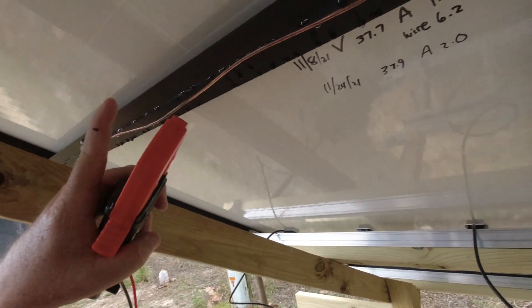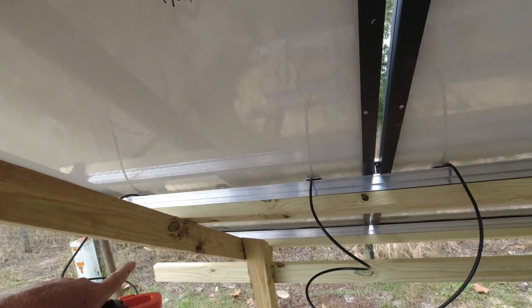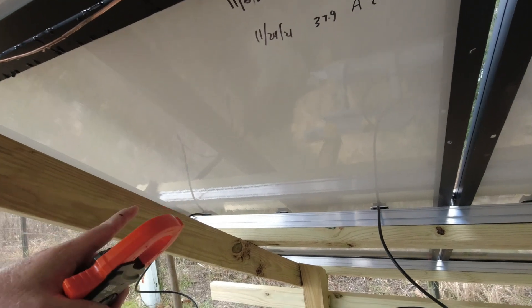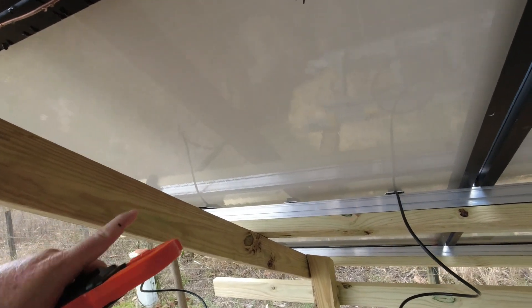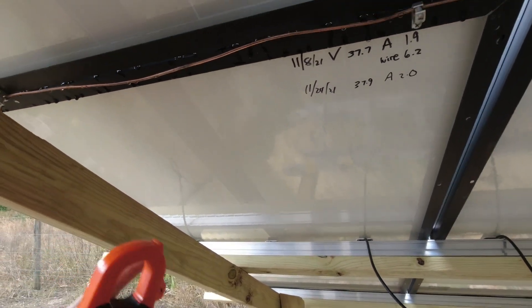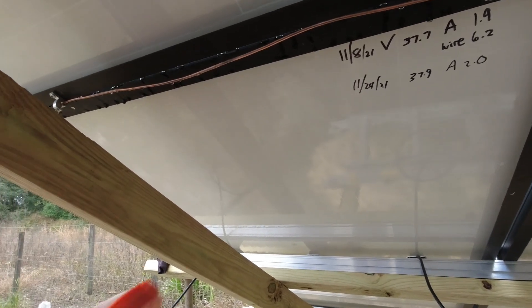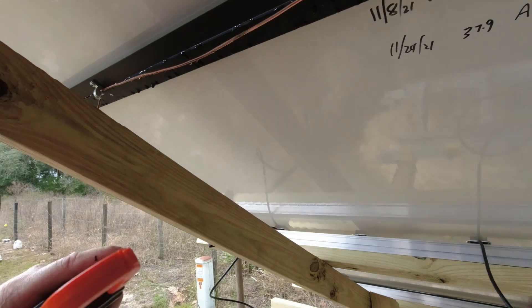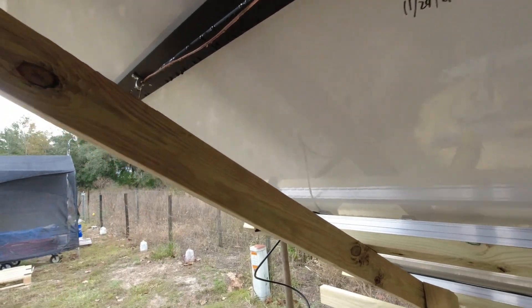These are all fixed at about 32 degrees, but for winter in my area they should really be at 45 degrees. They're not quite south-facing but pretty close. This is representative of a roof installation. The only way to get more output would be to buy one of those solar trackers, which are really expensive. Today is cloudy.